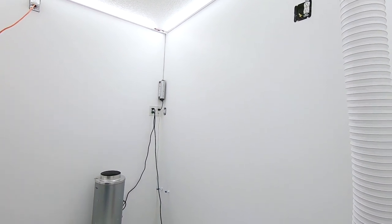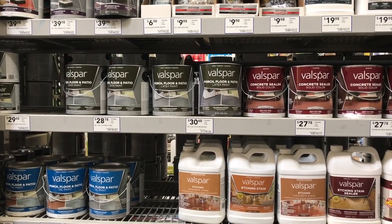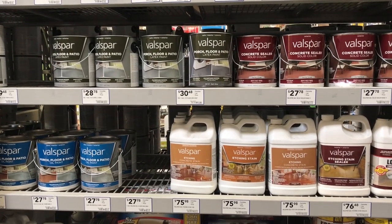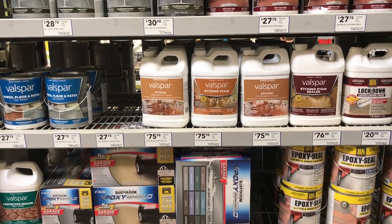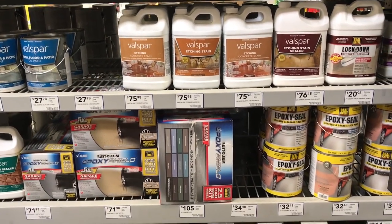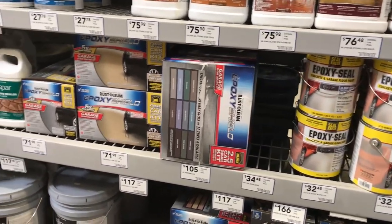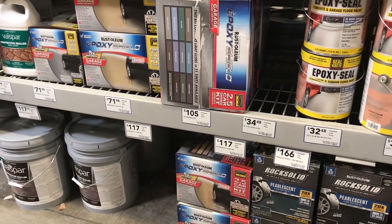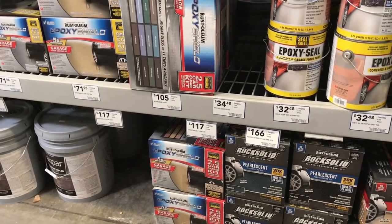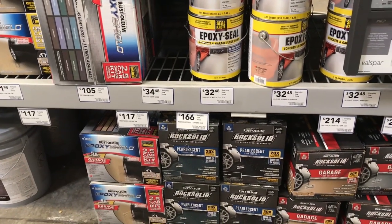Now for the floors. I've installed just about every kind of floor epoxy on the market — my dad and I did some PPG industrial coatings back in the day for shops. I've done the Benjamin Moore, the Valspar, the Quick Seal. The Rust-Oleum stuff you get from the hardware store is fine, but it's not that pure. It's not that 100% solids epoxy — they add xylene and other thinners to give more coverage so you can fit your car and your wife's car in the garage.